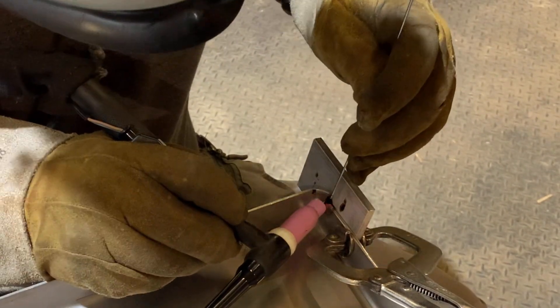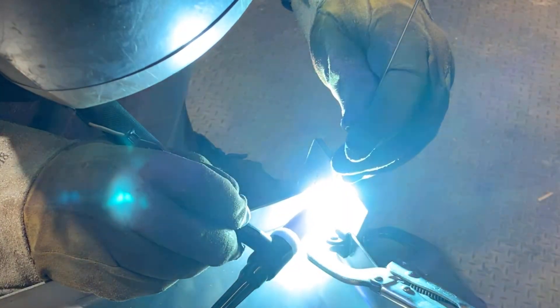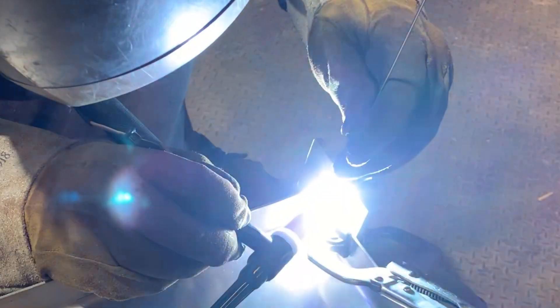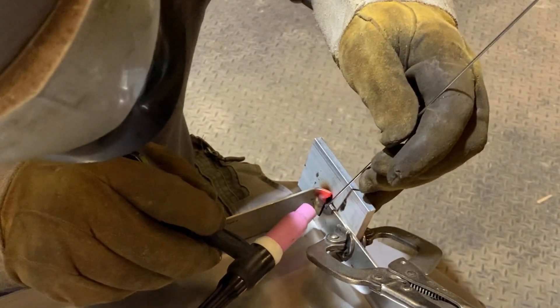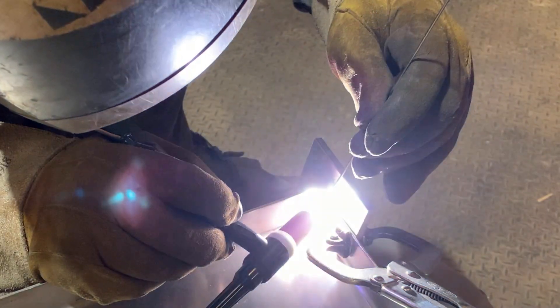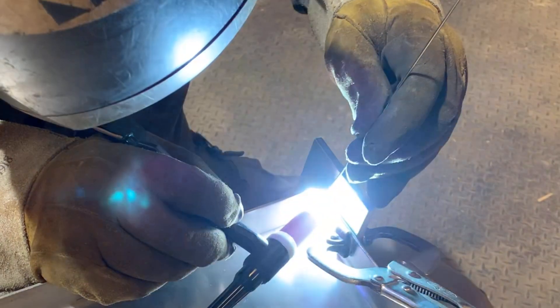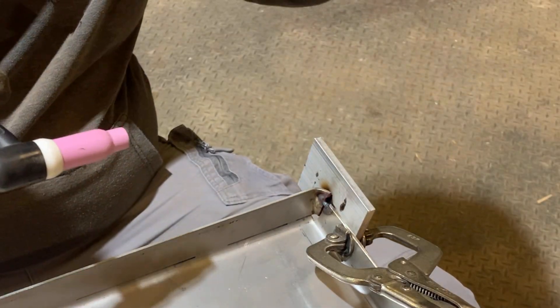That corner is melting away — let's try a different angle. My biggest problem really is that I can't properly see what I'm doing. The only thing to do is keep trying things until it works. The shade of my helmet being a little too dark, combined with being in a corner that's hidden by the torch, and the fact that I'm used to aluminum — all compound together. Skill and talent take time to build and this is just the beginning. The two halves are joined together at the top now. Getting a little bit of what they call 'sugar' burning through on the back because it's a corner I can't back properly.